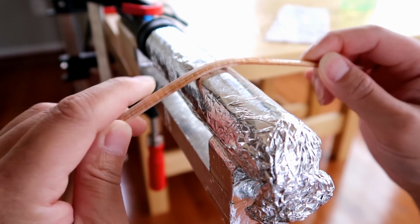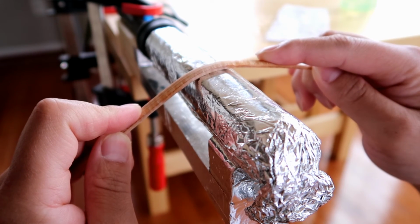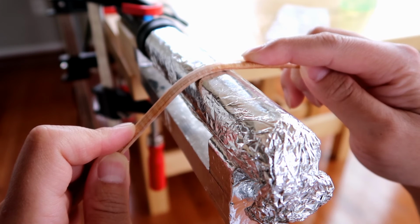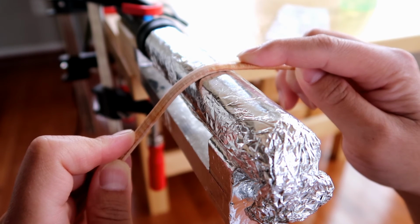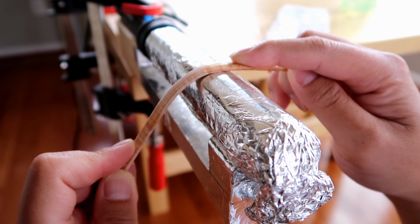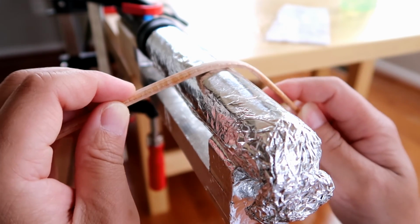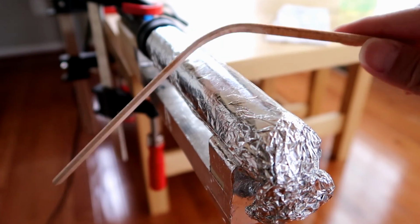That tension, the pressure that you're putting on it, it'll actually start to relax around it. And you can see here, the 1.5 inch diameter is a little too small. But if you've got a choice to buy the 2-inch one or even bigger, that would be better. But it does get the job done, and slowly, steadily, just bend it around. With anything, it takes some time, some patience, and a little bit of finesse. Practice on some scrap wood first, but if you're diligent and take your time, you can get pretty good results.